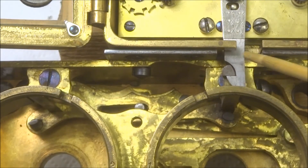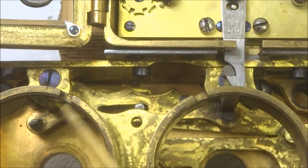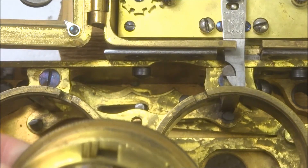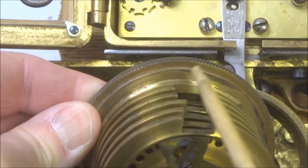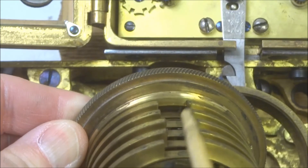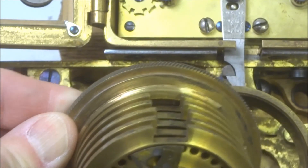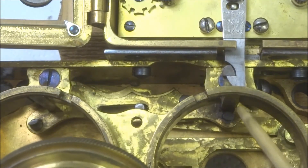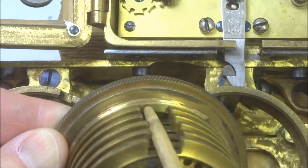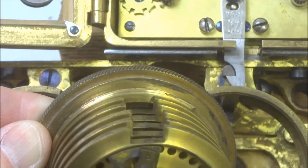This piece here is holding this piece up, and what that does is it holds this fence — this long piece here — upward. As long as that's being held upward, it cannot fall into the space designated by this tumbler here, this wheel pack, which is a five — one, two, three, four, five — combination wheel pack.